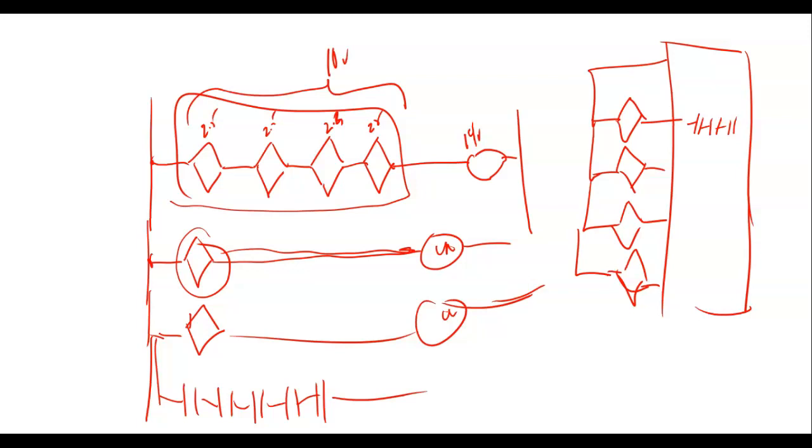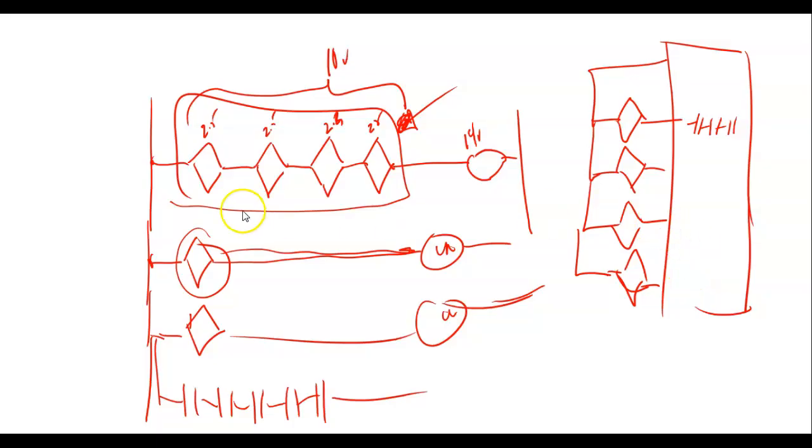But in relay logic, we got to be real cognitive of, when I start using these solid state relays, how many am I going to be using, right? Y'all understand that? Yes or no? PLCs, we don't care. I could have 50 solid state sensors, because we're not hooking them in series. We're not hooking them in parallel either, guys. Each one of them will go into a different input.